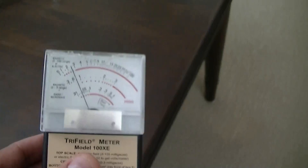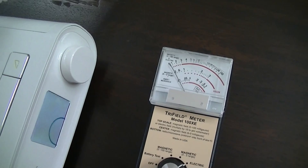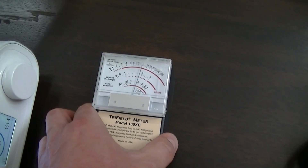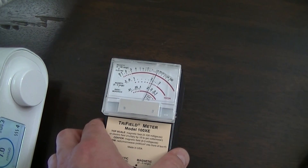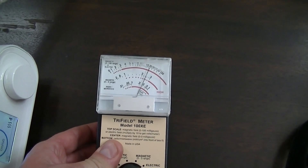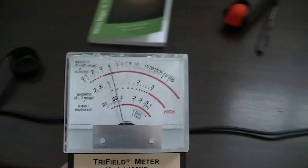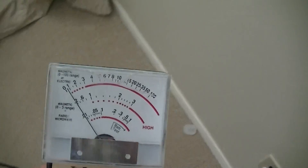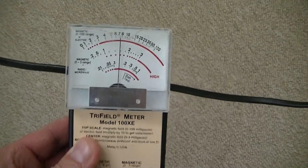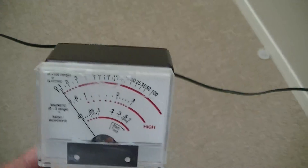Let's go back to the box, turn it on, and see what happens. You'll notice that it's picking up a field from me — when the human body is in an electromagnetic field, it gets energized by the field, and the Tri-Field meter starts picking up the field being induced into your body. We've got the field coming off the cable; our electric field with the equipment on and pumping air is about two feet.